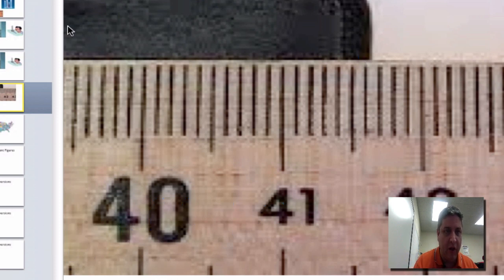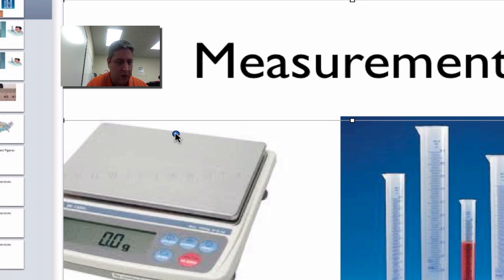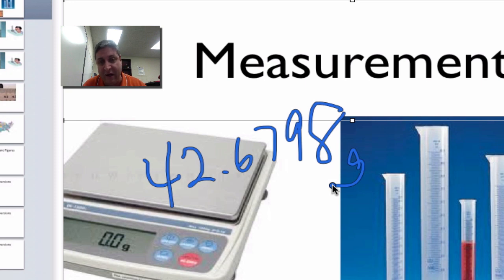The good news is you don't have to worry about this on a balance, because it will tell you right here — to the nearest tenth. So the answer's always going to be to the nearest tenth, because that's its degree of certainty. If someone does calculations and tells you it's 42.6798 grams, I'm going to say that's wrong — this balance was only good to the tenth. So I might say 42.7, rounding up, but I can't go any higher precision than that. We will work on some measurements in class. I hope this makes sense — feel free to watch it as many times as you want. There's going to be another video on significant figures and conversions. Thanks for watching our very first screencast. Have a good day.